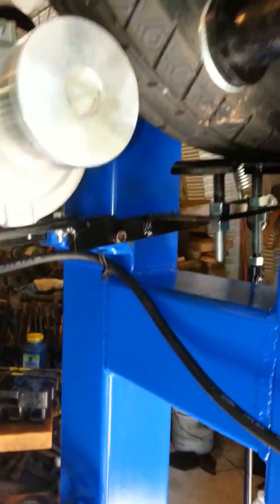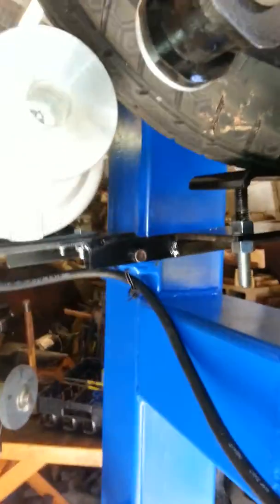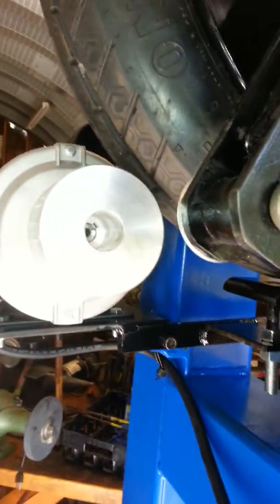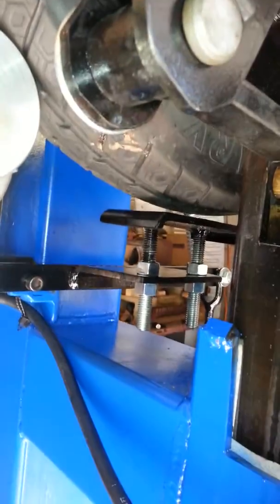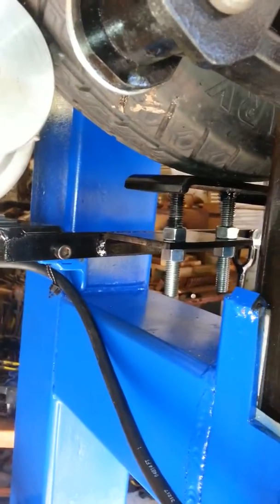I was asked about the braking assembly on the hammer. As the treadle is pushed forward, which engages your pulley, the brake releases and allows the tire to spin freely. Whenever you release the treadle, the brake automatically comes up as the pulley moves away from the motor. So it's a very efficient, very simple, well designed system.